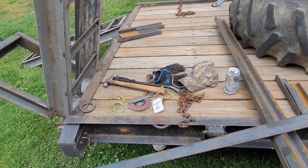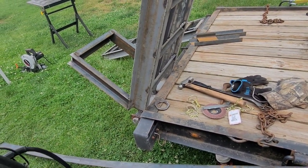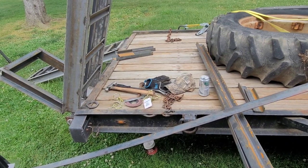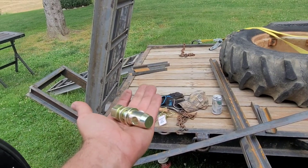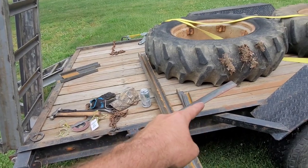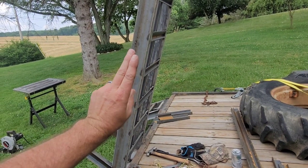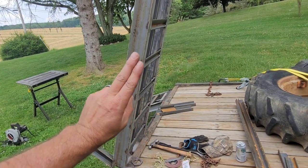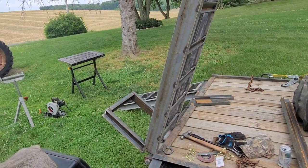All right, I guess next, I might as well tack that plate back on there, because I don't think these are coming back off. So I'm going to go ahead and get that done and then start cutting these bars. Actually, no, I'm not going to cut the bar. I've got to weld these in place first, get my distance. I'm actually probably going to drill a couple holes in there. Depending what I'm hauling on this trailer, if I don't want these ramps tilting this way, if I have to bring these ramps straight, I'm going to drill an additional maybe 3 holes. So I actually have an adjustment to those ramps where I can move them so they're not stuck in one place. I haven't seen that yet, but you will now.